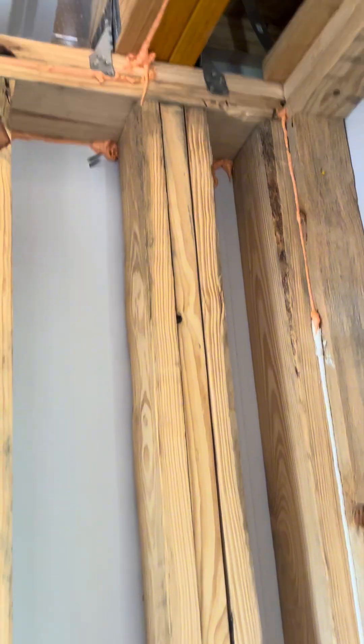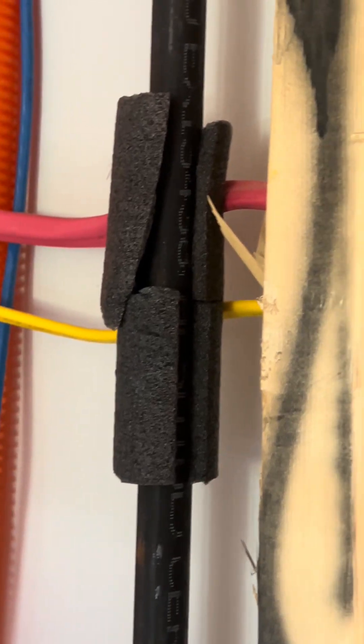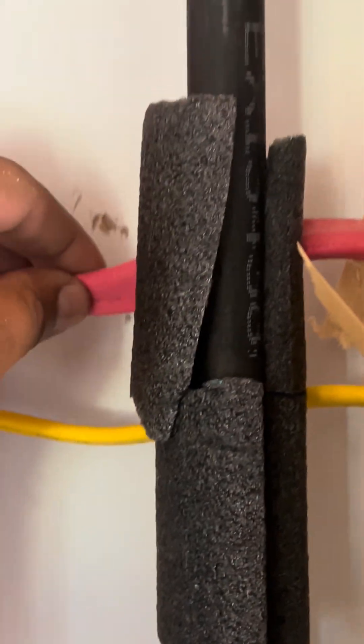Push the head all the way up because we got load at the top. You have your gas line in contact with electrical — it needs to look like this: add insulation to give it proper clearance so it's not touching on the backside. That's how it should look.